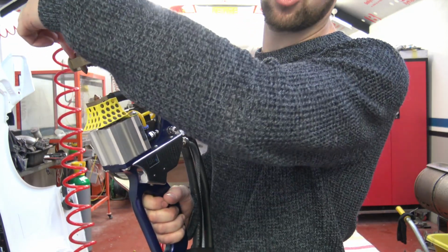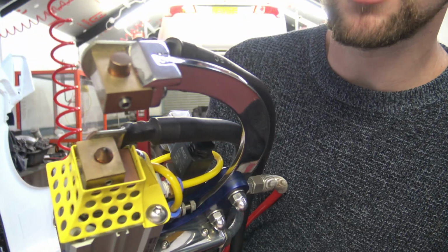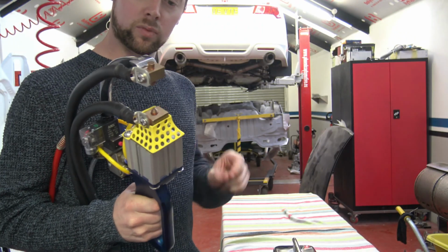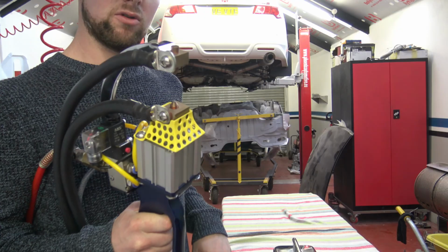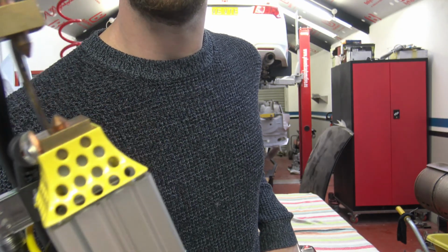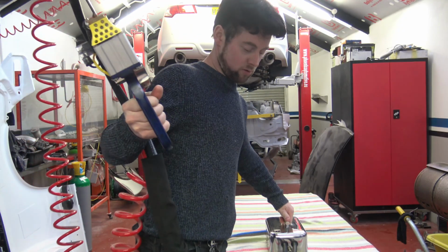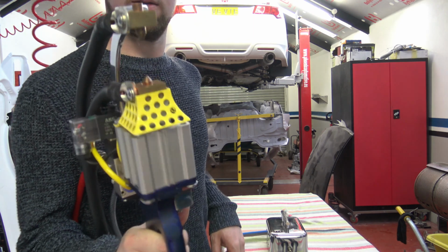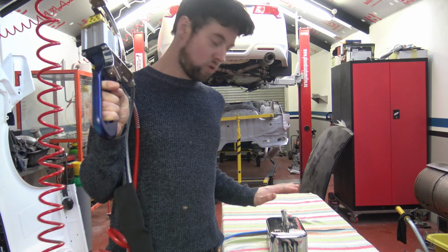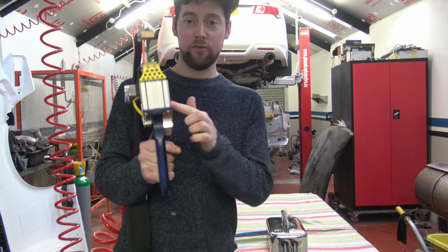I have this electrode taken out further than it should be using this Allen key. See the Allen key at the top there? So there's about a 5mm gap so that I don't cause any sparking of the electrodes. Those electrodes at the minute are too pointy. They need shaped and more in a ball, because I noticed that it wouldn't weld as well when the points were like that. So 90% of the parts on this whole project are specifically made, handcrafted, apart from this pneumatic cylinder